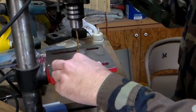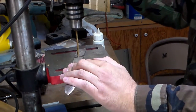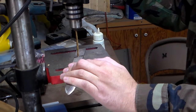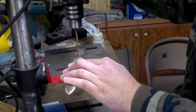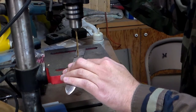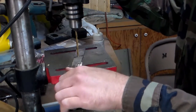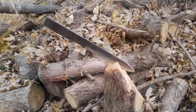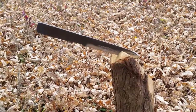The last thing I did was attempt to drill the pin holes for the handle, but what I found out is the drill bit I bought was either too cheap or this file was just that hard — in the end I barely scratched the file and I ground the entire tip of the drill bit smooth. So if anybody has any tips on how to drill through hard metal with a drill press, or maybe I just need a better drill bit, I don't know. In the next video I will attach the handle and show you the solution I found for that. If you found this video helpful or informative please like, share, and subscribe, and I'll see you in the next one.